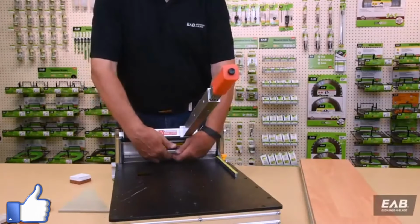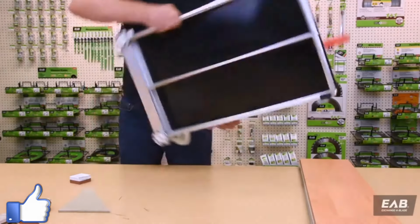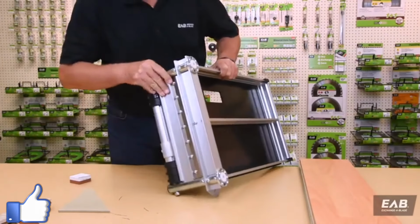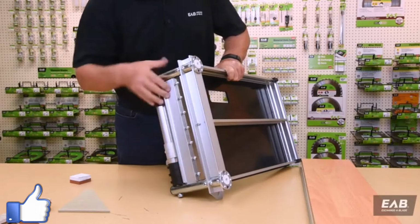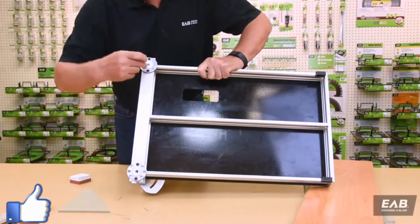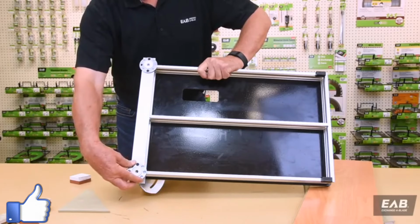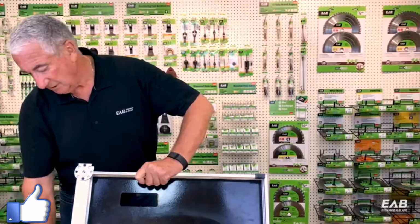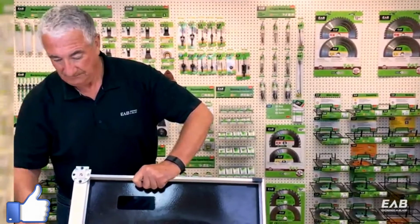When the blade gradually wears down, you can adjust it, because it's very important, obviously, that the blade come right to the bottom so that it connects and you get a clean cut. To adjust your blade, you just disconnect these four screws in the bottom, and you can rotate these two pads so that you will get a nice, clean, perfect cut.